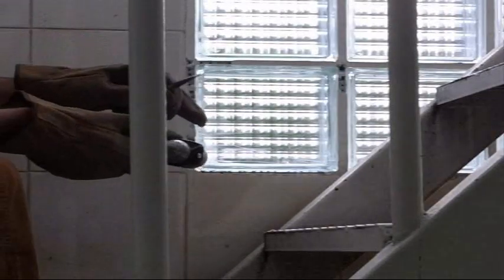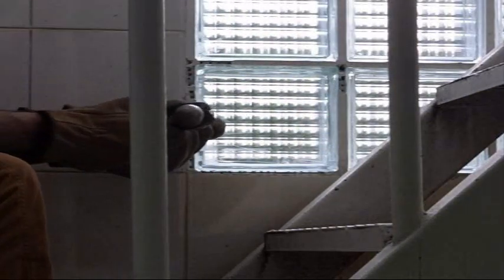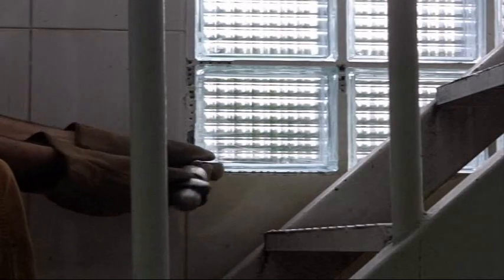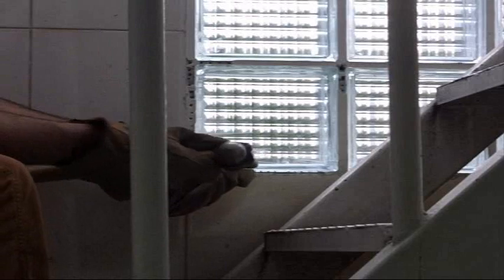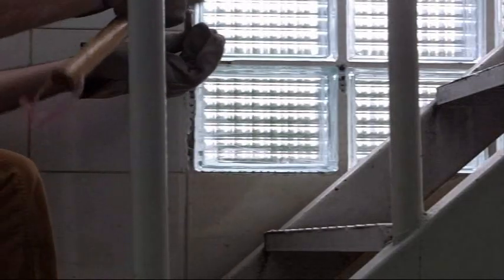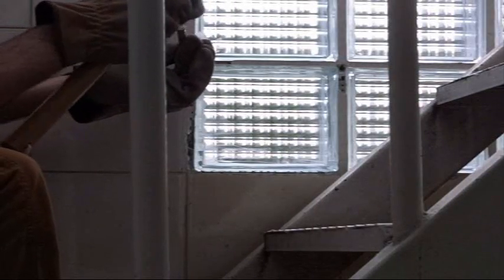When I break this block — and that's going to be the strategy — it's going to try to expand. When you crack glass it expands, and I don't want to crack the surrounding blocks. So I'm chiseling to give it some buffer room so that when this block pops, it won't take out the adjacent blocks with it. Down here I probably have something to work with, and up here the gap is much bigger. Then I just try to weaken it between the two holes — carefully.